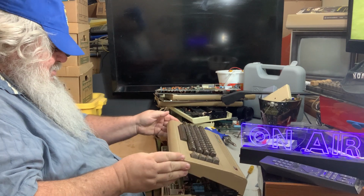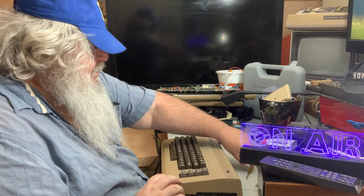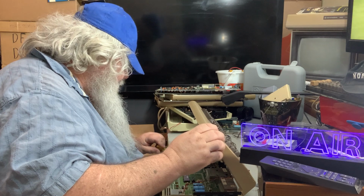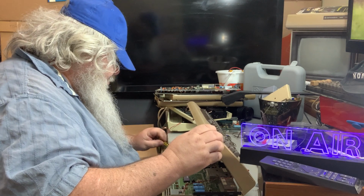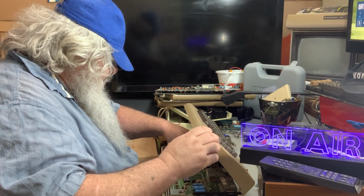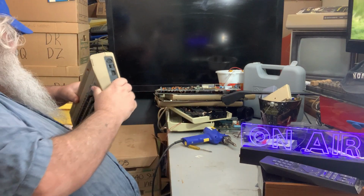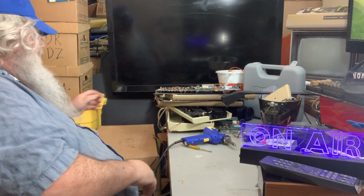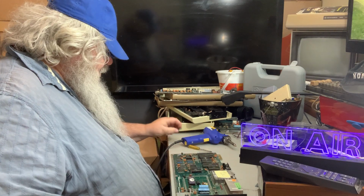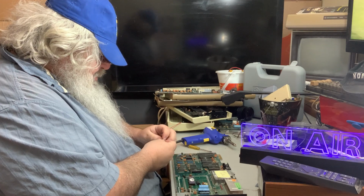Alright, the truth is, it's there. Okay. So, and this one, oh, was it U10? It was U10. Okay, so we're going to delicately steal this RAM chip out of the 64. Set the 64 back here. Bring out this board. Check the chip, check the pins, check the everything. Make sure we have the witness mark.